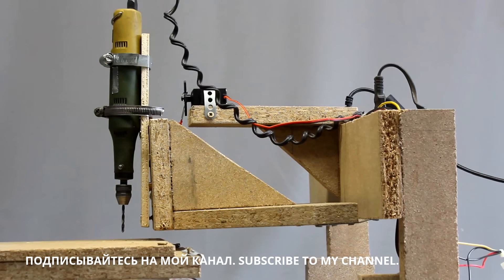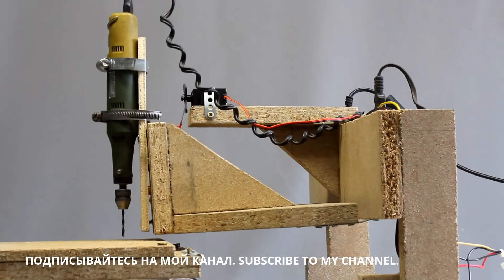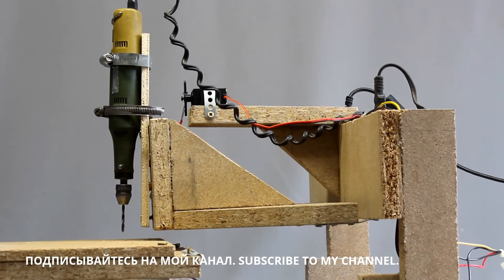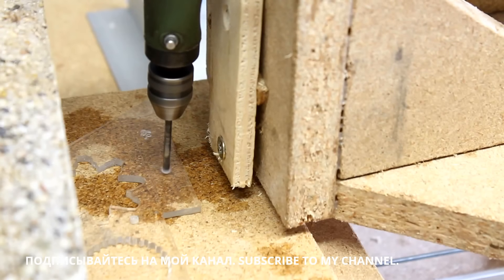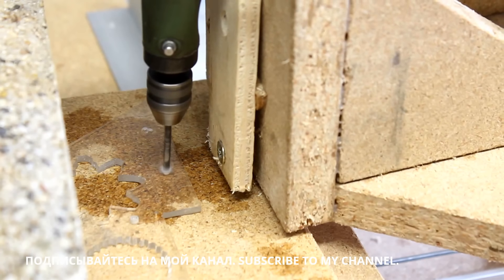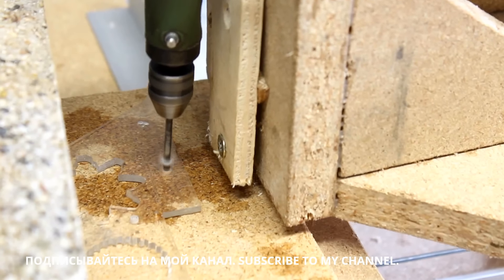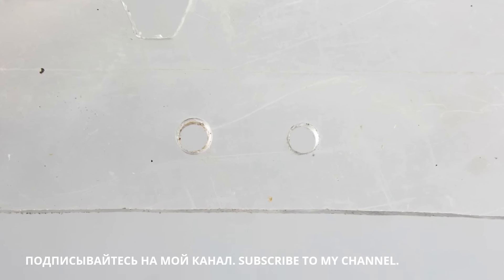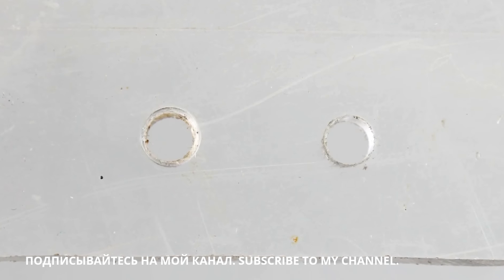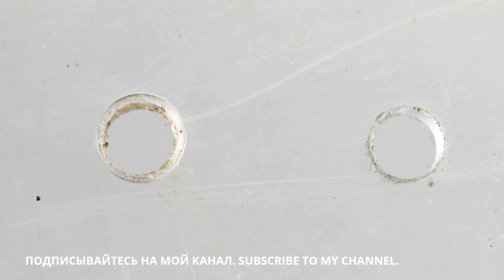When lowering the vertical axis, there is inevitably also a movement along the X axis and the router tilts slightly. Both causes an oval-shaped drill hole in theory. In practice, that movement is negligible. To the left you can see the hole drilled with the CNC machine; the hole to the right was done with a drill press using the same 3mm drill bit. The CNC machine is not free from clearance, thus the hole is not as smooth as it ideally should be, but it's not oval.